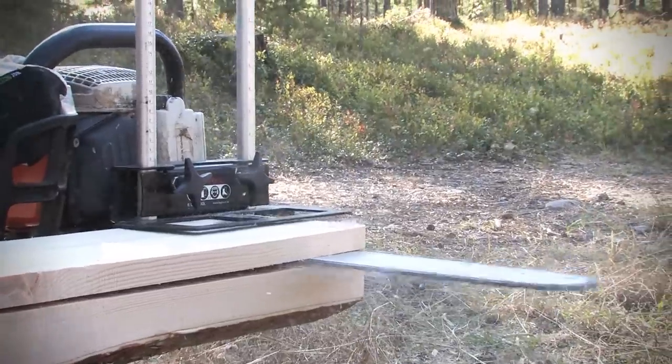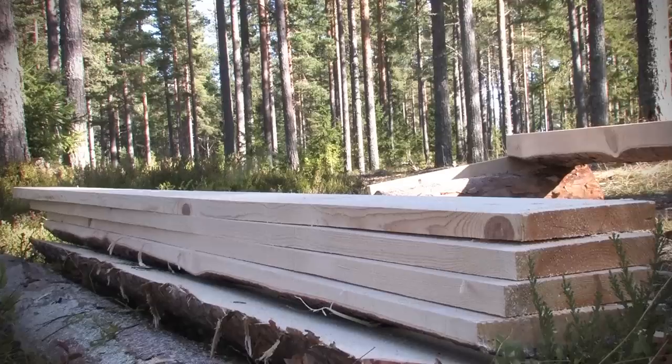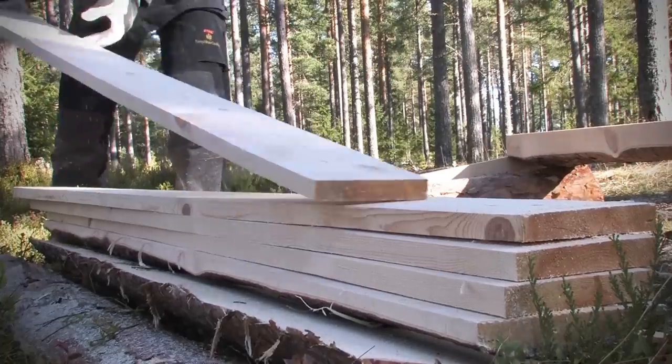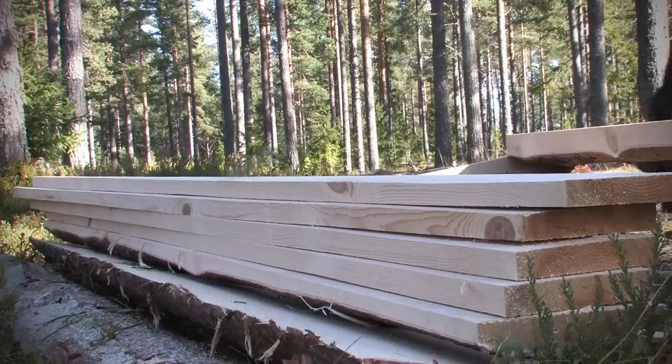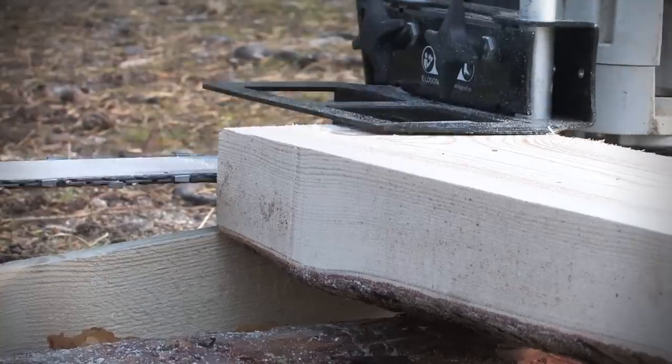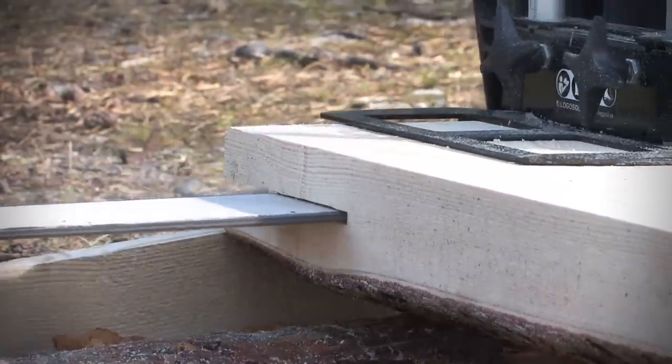Start with a timber jig, you can later upgrade your equipment to a big mill basic with a guide rail of aluminium and adjustable rail supports of steel. You can have the equipment that suits your specific sawing requirements. Watch out for the screws of the support board when taking the last cut.